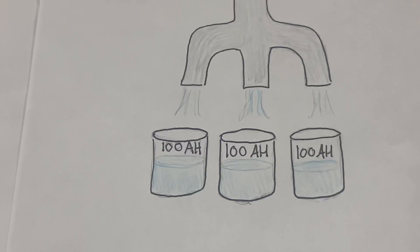We don't want to discharge the batteries too heavily or we'll shorten their life. So if you undersize the battery bank, keep in mind there are multiple downsides to that — not just the fact that after one or two rainy days you're running out of power, but also the fact that you could be taxing the batteries pretty heavily.